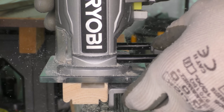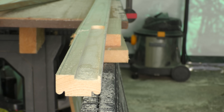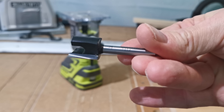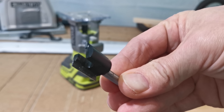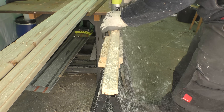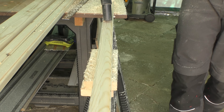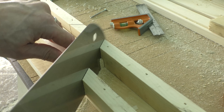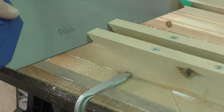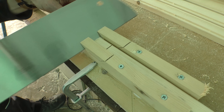The next job was to route out the rear of the horizontal fascia that fronted the main carcasses and top boxes, to accommodate the metal strip I'd screwed on to strengthen the double carcasses. I did this with a hinge mortise bit from Wilden Tools, using the fence to keep the router in line during the cut. With all the fascias now routed, I had to remove beading at each intersection of the fascia, and to make life easier I made two jigs to slot the fascia into, making each cut consistent.